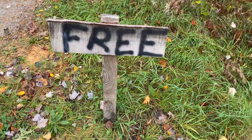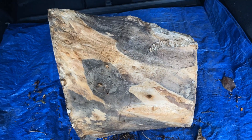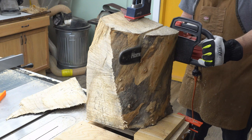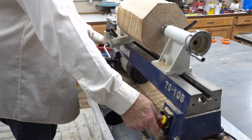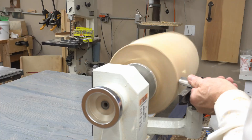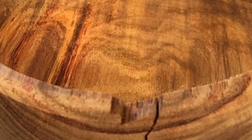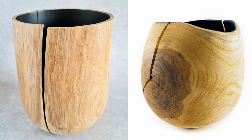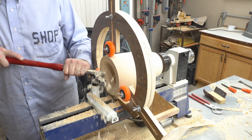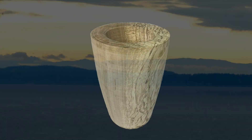A couple of months ago I stumbled upon a free tree stump sitting by the side of the road. It was freshly cut but I wanted to try and make a larger flower vase out of it. I made some initial trim cuts and then started to turn a thick rough vase blank on the lathe. The problem is freshly cut wood likes to twist, deform, and split as it dries, making it a bad candidate for turning a bowl or a vase. So this experiment will take a green piece of wood with an initial rough turning on the lathe and then try to accelerate the drying process without it cracking before final finishing.